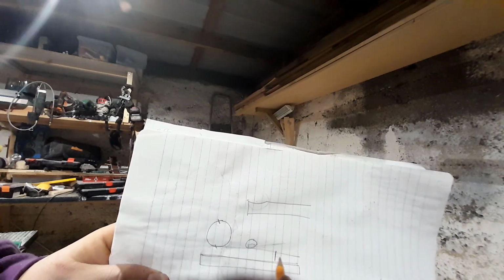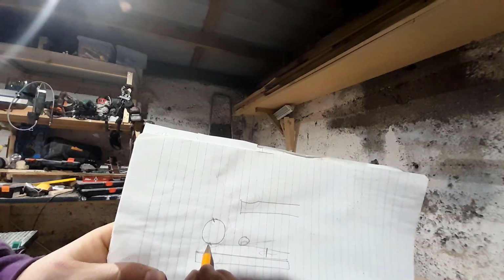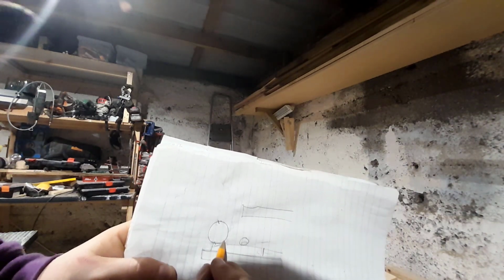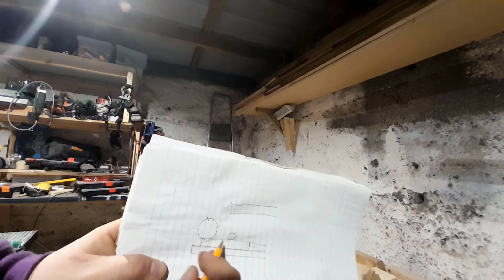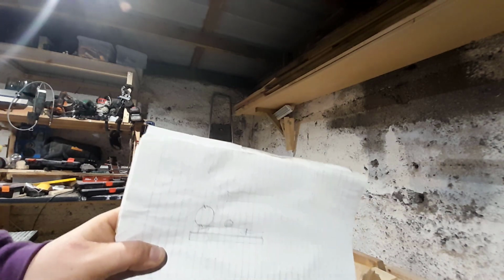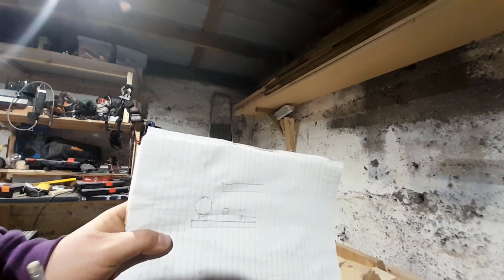Whereas if you feed them in one after the other like I did, you reduce the risk. And I always keep the same part on the end, starting at the end, sorry. So that means the snipe only happens on those two boards, so I can cut it off. Whereas if I was leaving gaps, every board would get a little cut off the end. Now you can avoid that by always cutting over length, and you can chop it off, but this is a good method too.